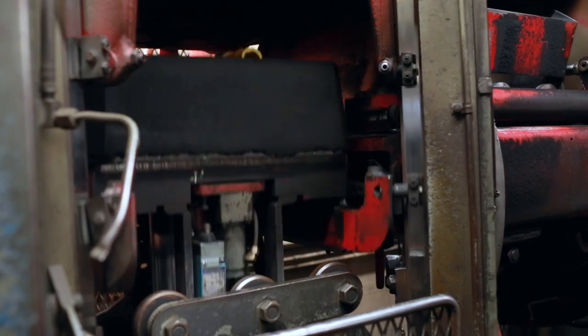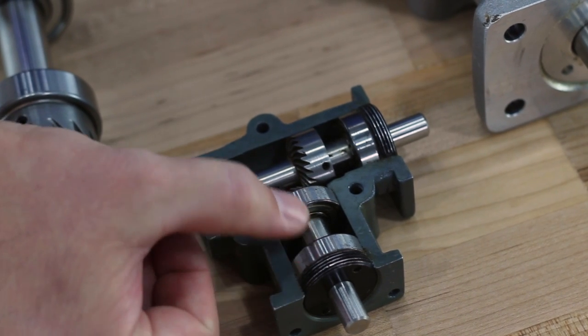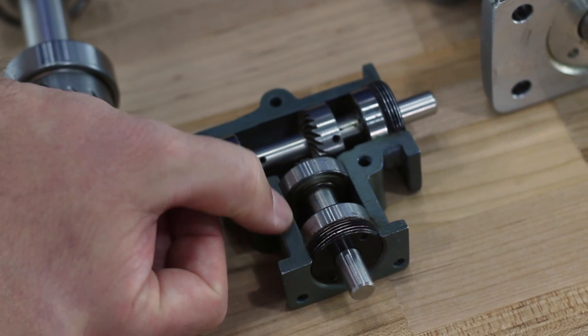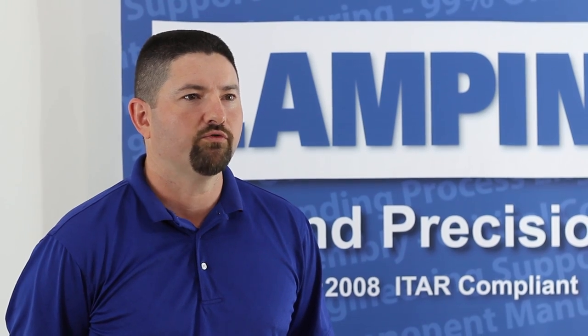The cores take up space in the mold cavity, reducing the amount of aluminum necessary to produce the casting, as well as minimizing the amount of material needing to be machined to create the precision surfaces for the bearings and clearance for the gears. The sand is packed around the patterns for the gearboxes, creating the mold for the castings.